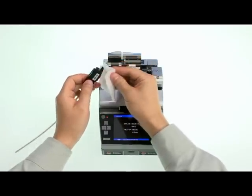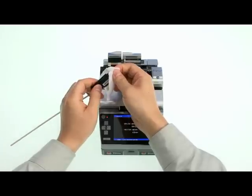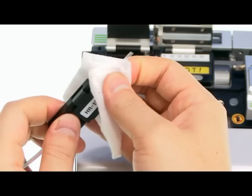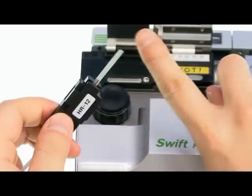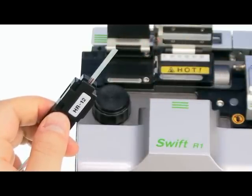Checking the cleaning part: it is very important to clean 12 millimeters from the edge of the coating. The cleaning liquid comes out when pushing the LID. After cleaning the bare fiber, flick the fibers to separate each one. Refer to the instructions on how to fill the liquid container.